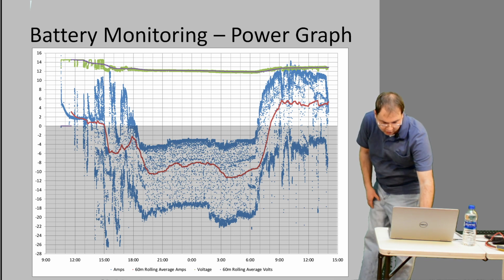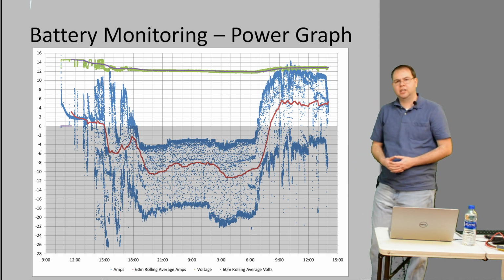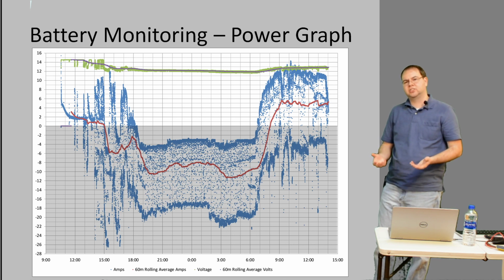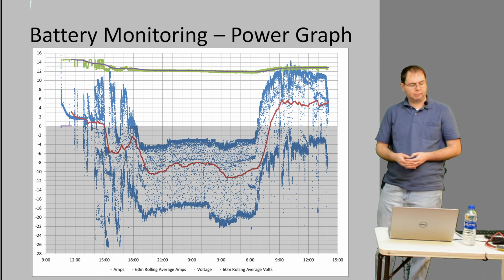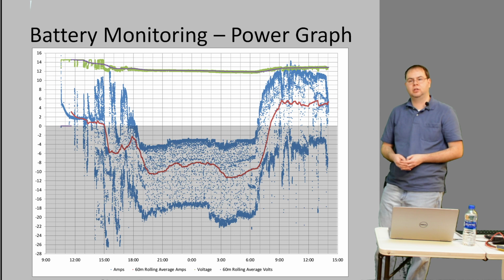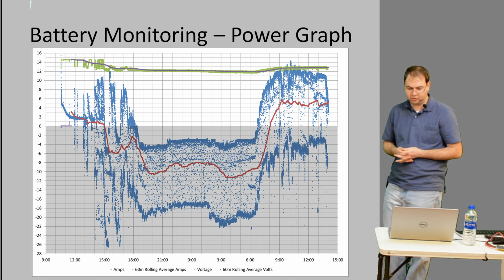Had a question: can you use a shunt for AC current? I'd like to take an AC current measurement. I haven't actually attempted to use that. I don't know if you'd need a different sort of meter. Really, it's just a big resistor. I suppose it might work. I might be able to get back to that. I might be able to do a sort of bench test with a low voltage AC transformer and a small load, and that would be interesting to see. Since it's just a resistor, I guess maybe it would work. You'd just have to be measuring the amount of loss across it, but I haven't had as much experience measuring AC voltages. I hope that answers the question somewhat.